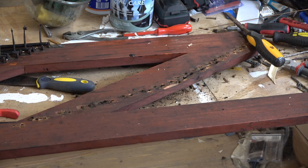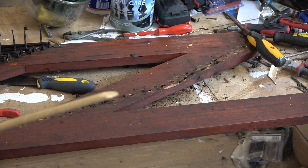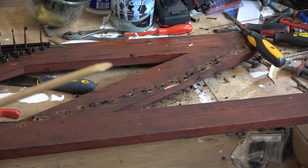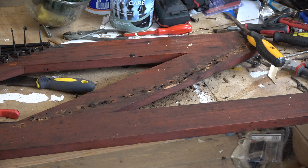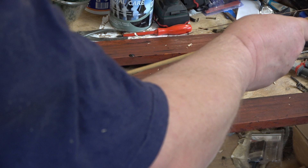So you think, oh, that's ruined that piece of timber - but there's a way out of it. The way it's done is with a piece of doweling. These holes are infilled with wood. I actually get a pencil sharpener - it would be quicker - but of course I'm doing it the traditional way with a chisel. What we have to do is dip that wood in glue and put it in that hole, and then bash that in.